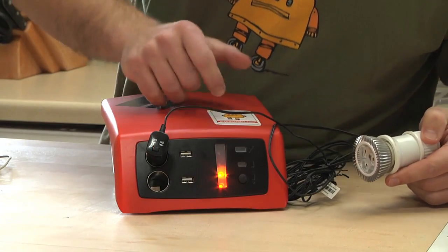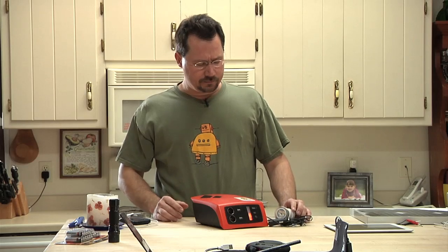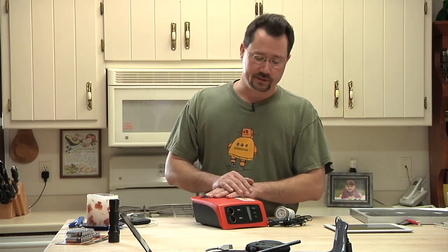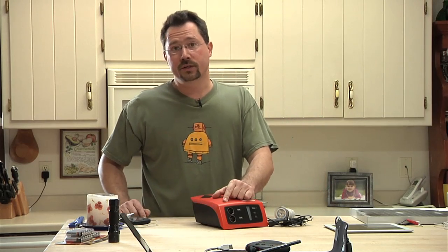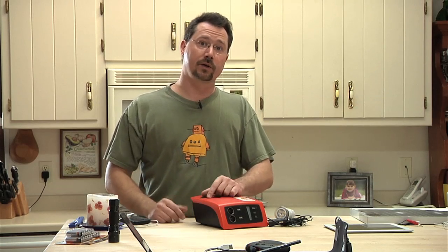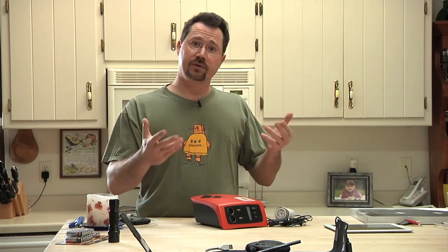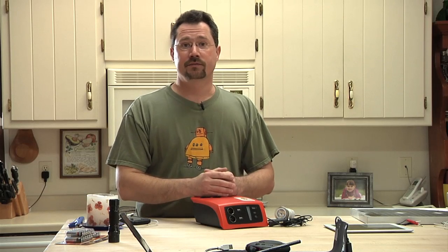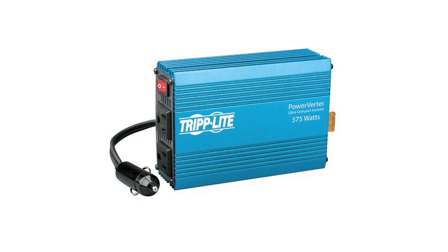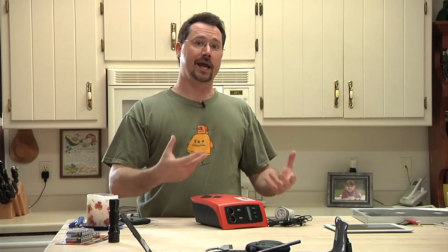We also have a nice gauge — right now it's a little bit low since it's been cloudy the last couple of days. This is a neat unit because you can charge it from solar, it holds a fair amount of power in the lead-acid battery inside, and you have both 5 and 12-volt outputs. With that 12-volt output, you can use any of your car accessories — anything that takes a cigarette lighter plug. And actually, that's a nice segue: if you've got a car in your driveway, right there you've got a big 12-volt battery, and if you need to charge it, all you have to do is start up your engine. You can run an inverter in your car, run an extension cord into your house, and now you've got AC power for running things like a refrigerator or a lamp.